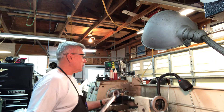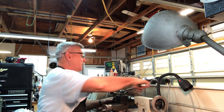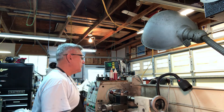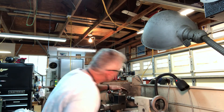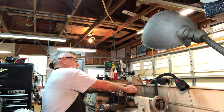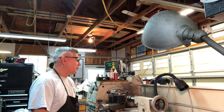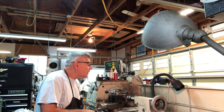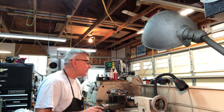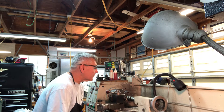I hope you all still like these longer videos. Somebody sent me an email after I did the one where I did the assembly on the Gingery Shaper — he said you should do longer videos. So I want to get the clamping pad area pretty much vertical. The base is clamped in there. That's the zero — I'll go in a little bit and see if that scribes the line in the cast iron.